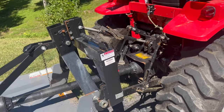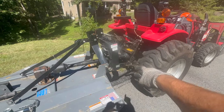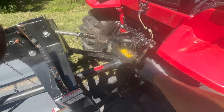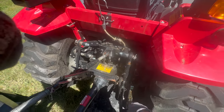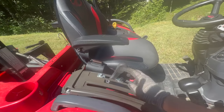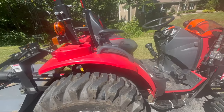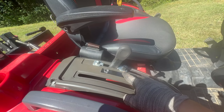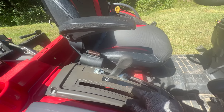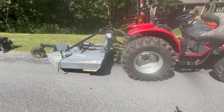Also this three-point back here. Now why I'm saying it would be transmission or transmission-related — the three-point here, you see these three-point arms. For those of you who didn't know, like I didn't know before this tractor, this three-point is controlled by this lever right here. All the way up, the three-point's all the way up; all the way down, the closer you can go to the ground. Now it used to not need this locking area. You turn the knob, it tightens down and it doesn't allow this to go forward any more than what you have it to. You would just be able to free float it and it would stay. Now that doesn't lock and stay, and this always wants to drop right to the ground because that lever falls right down — it goes right down immediately.